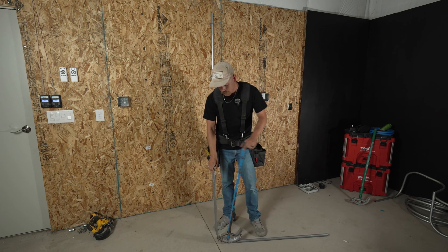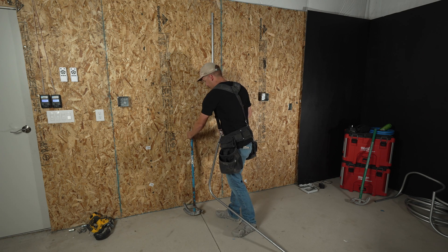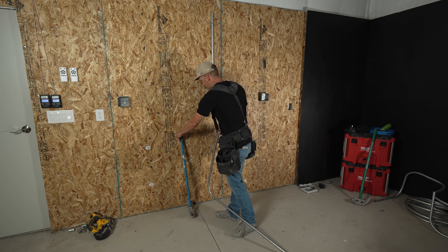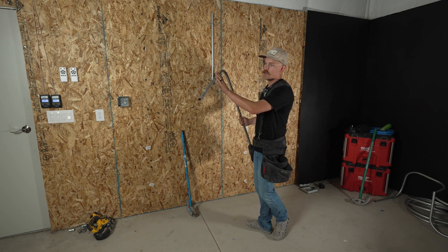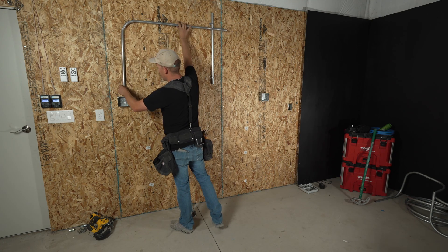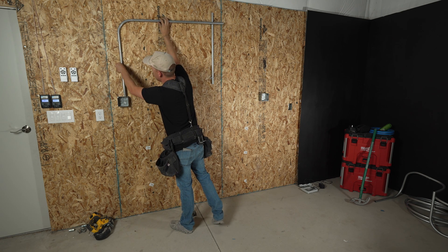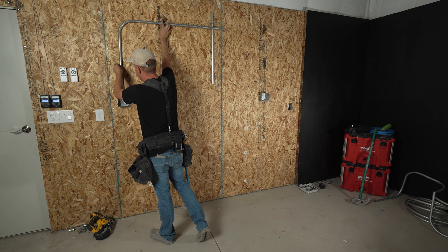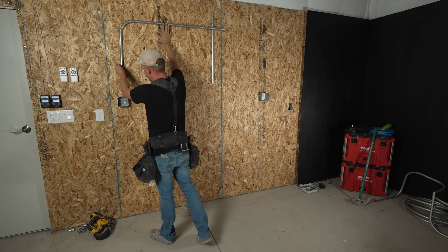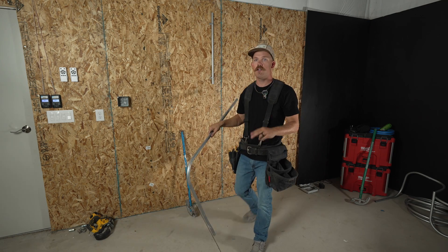And that looks pretty good — at least for my crooked eyeballs. So there — you're unhooked. There's my first 90. I've got my box offset oriented right — it's just perfect here in this knockout — and I've got my 90 here. We're pretty much good to go. That is bend number two — your 90.